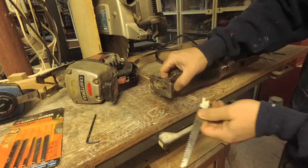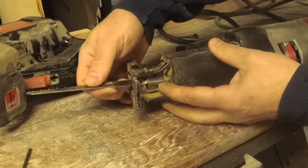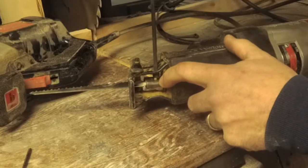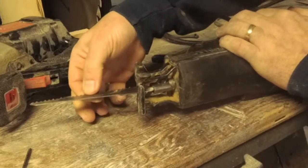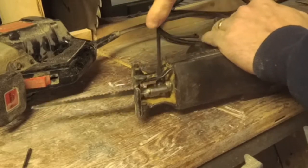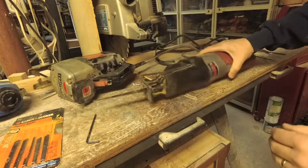They're very universal, but you certainly can't do the same detail work as you can with a scroll saw. To go ahead and put a new blade in, you're just going to make sure this plate is loose, then slide the blade in — lifting up on the plate a little bit so you know you catch on that little pin. Then if you just push down and hold it, you can go ahead and tighten this down. I'm not going to tighten it all the way yet, just enough so it's holding. I want to make sure that pin has caught that hole in the blade. Once I know it's caught in there, it's not coming out, and then we can go ahead and tighten this blade down really good so it's not going to come out. Now you can see it doesn't move at all. So that's pretty much it.